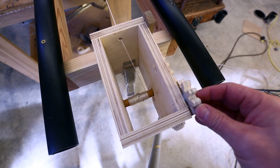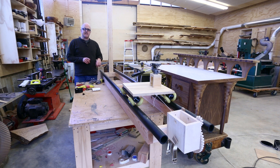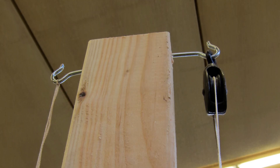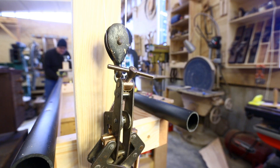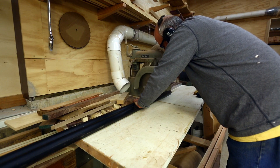That string is winding up around a dowel, and that pulls the dolly along. The string needs to be under tension, so there's a tensioning string that goes on the other side of the dolly and goes up the pole to a pulley and back down to some weights. That keeps the strings in tension.